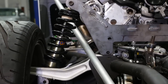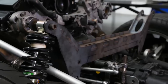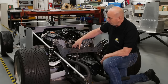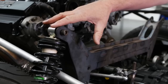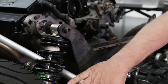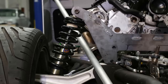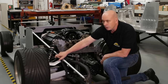In episode 12 I discussed the engine crossmember — this part here. You may recall that it was then still made out of wood. Now we've got it in place. This has been manufactured out of Domex and has obviously been laser cut. This is the mounting point for the shock absorber — it mounts at the top of the crossmember and sits down onto the upright. When the wheel moves up and down it pushes against the shock absorber coil and it's dampened by the shock absorber which is sitting inside.